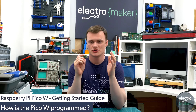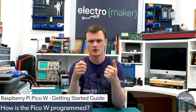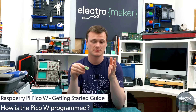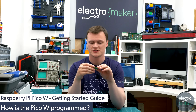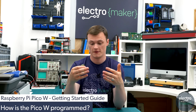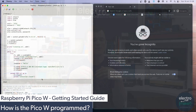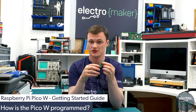C and C++ make excellent choices when you need maximum performance — for example vision processing or large data processing. But if you're making more of a DIY project and not doing anything too advanced, MicroPython is an excellent choice for two main reasons. First, MicroPython is just a version of Python that runs on microcontrollers and is incredibly simple to use. It's easy to program in, there are many libraries that support it, and a lot of complex functions are simplified into basic functions, which is really nice when you're trying to do a Wi-Fi project.